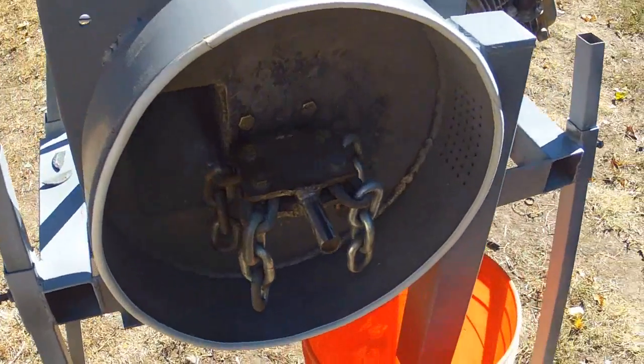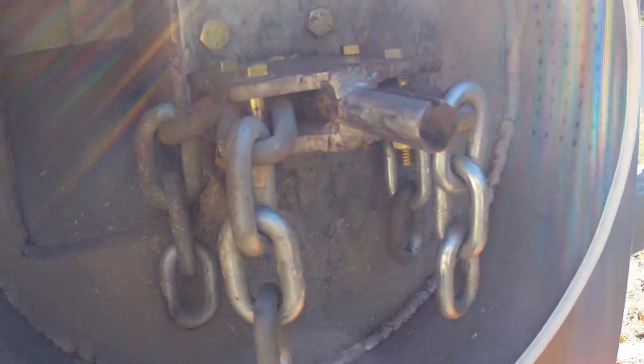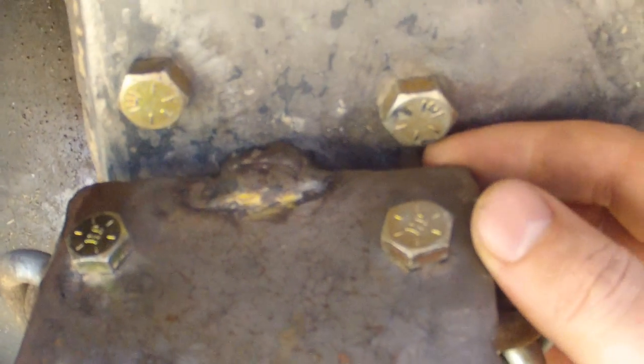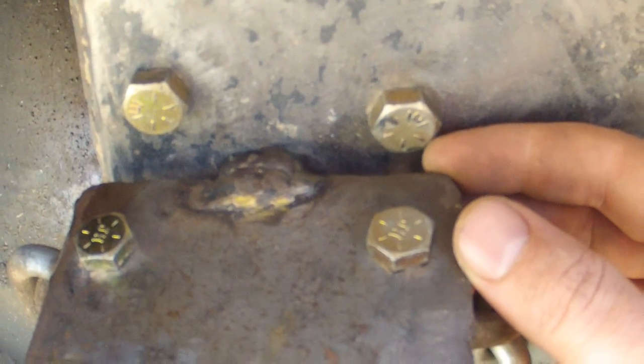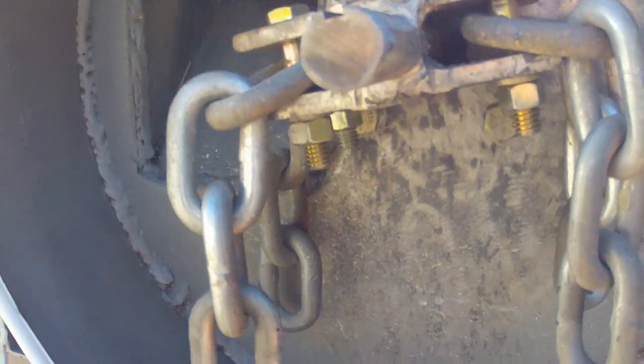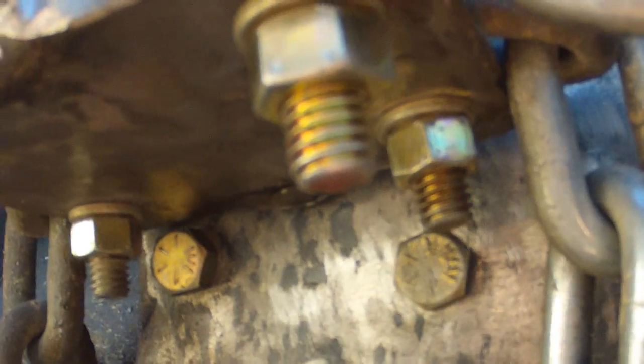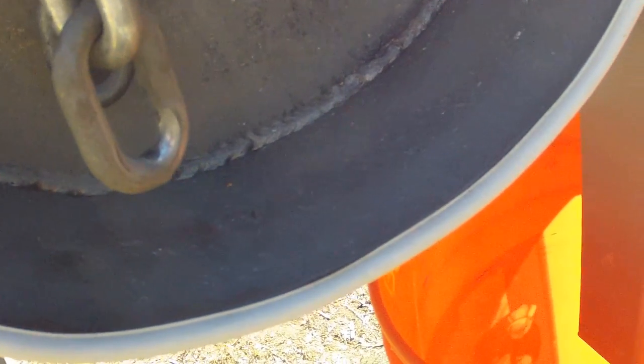The flail and the shaft are just some junk I MacGyvered together to get something working, and really they need to be completely redesigned. The tolerances between the front and back plate bolts and the flail plates are way too close. I used grade 8 bolts for all the interior parts, and really surprisingly, as you can see, there's almost no wear on the threads at all. On the other hand, the interior of the hoop is already starting to show pretty substantial pitting and dinging, so this demonstrates the definite need for a strike plate and harder metal.